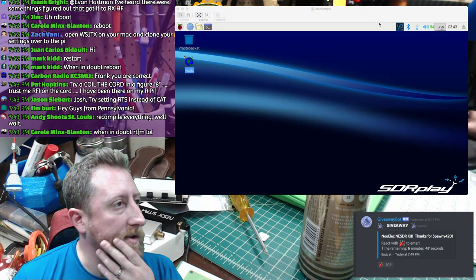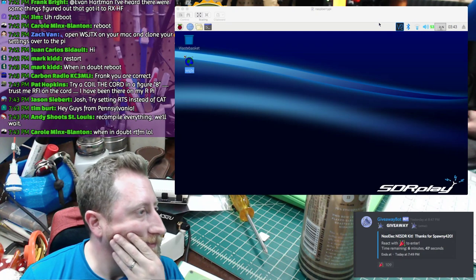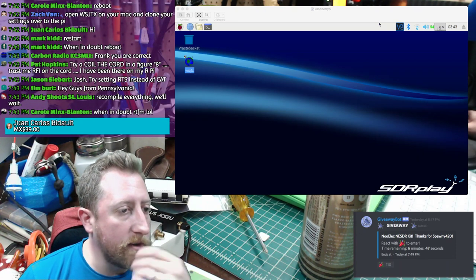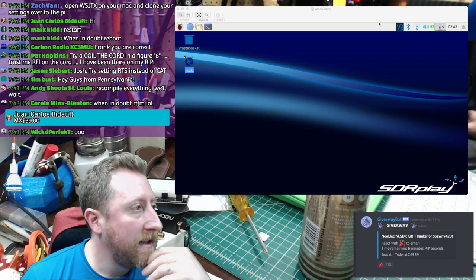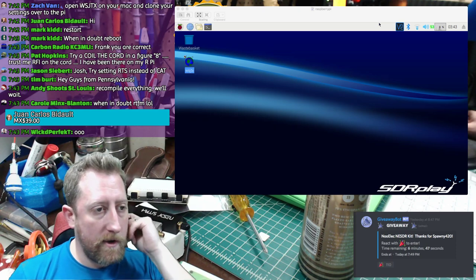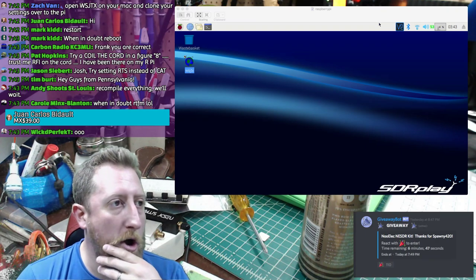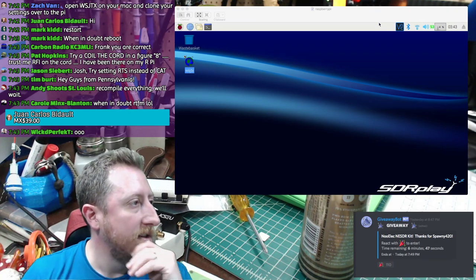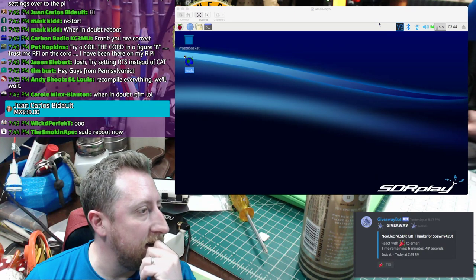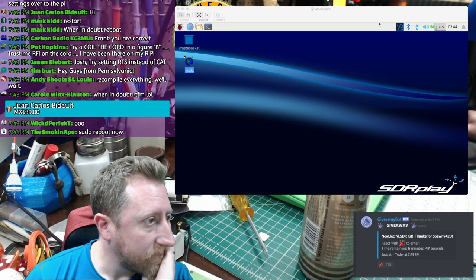No, I'm not reading the manual on that one. I've set up WSJTX on so many things. 8-1, none, rig, data... Juan Carlos, buddy, thank you so much. Yeah, cat. Should be cat. Juan Carlos, if you have a question, please post it. Recompile everything? No. I will not do that. Nope, this is it. Baud rate is set to 19, though, but that doesn't matter because I ran it both ways.